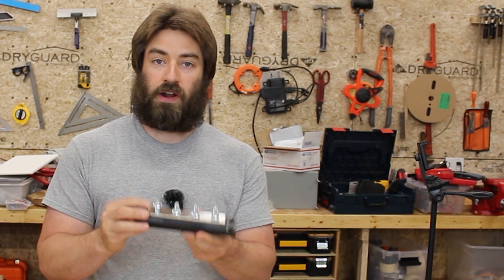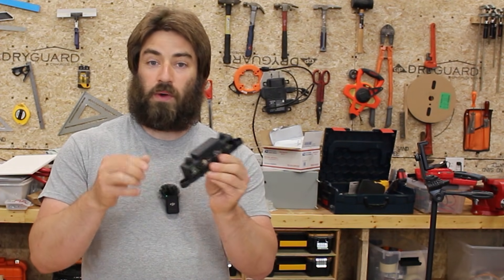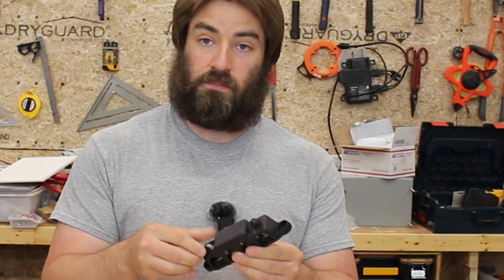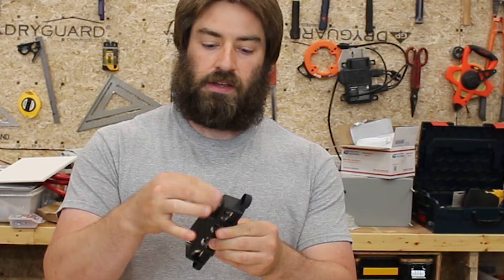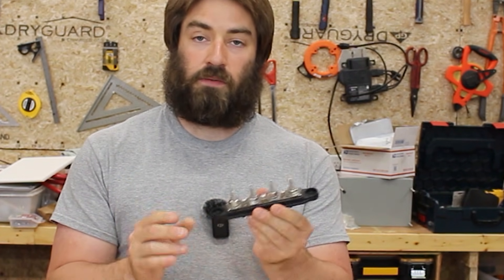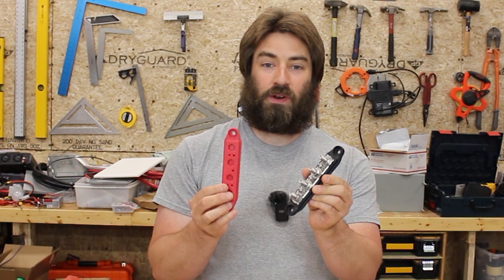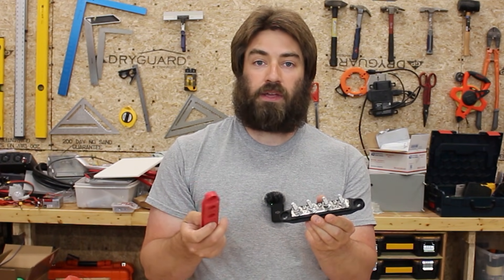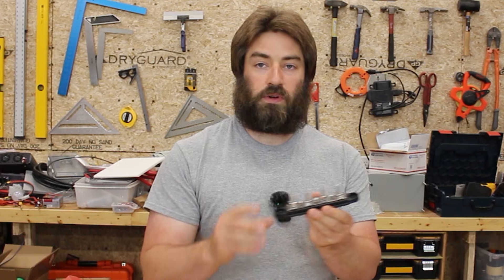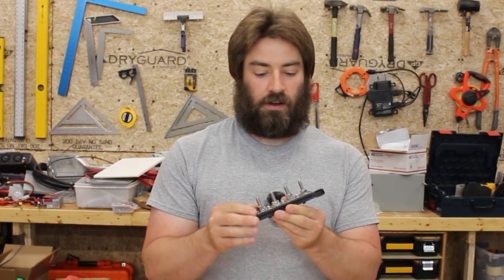In the description these were rated for 400 amps and I think they're actually being conservative. I'd like to compare this with a different bus bar on the market. Often times I see DIY projects done with these cheap bus bars — you can buy these black and red ones as a kit. They also have wing nuts and a cover, and inside four studs, and they're a lot less expensive. You can buy the kit of both red and black for only $40. This is perfectly fine for light, low amp applications, but I certainly wouldn't use this for over 100 amps even though the rating says 250 amps. I think that's totally bogus because these get really hot when you run them.